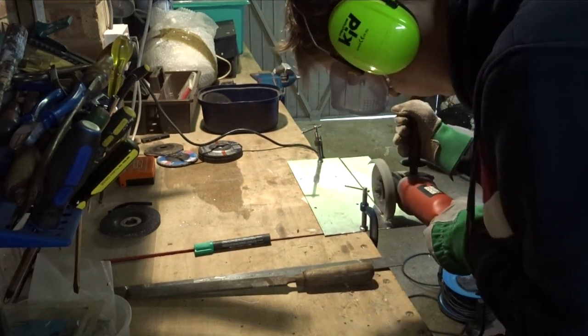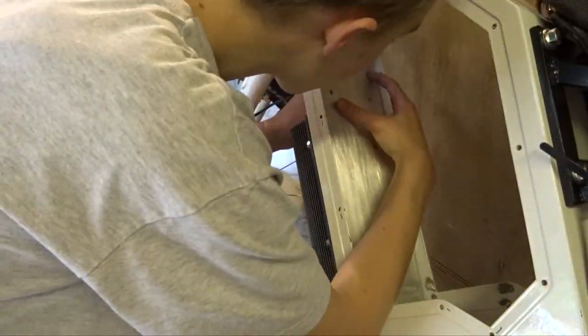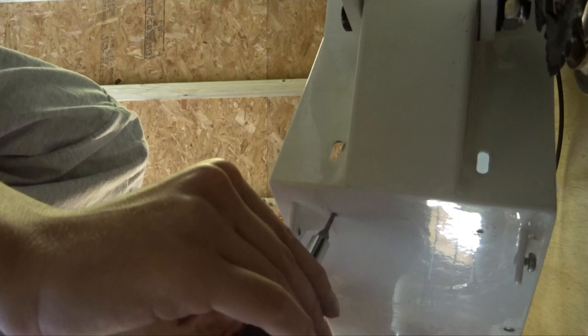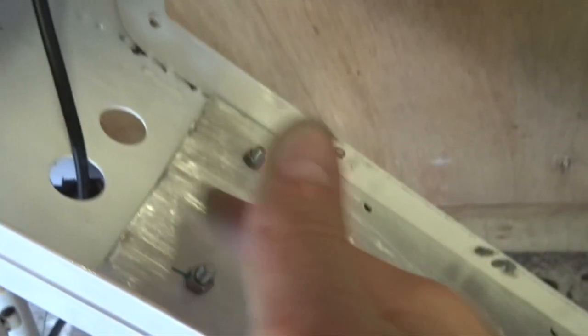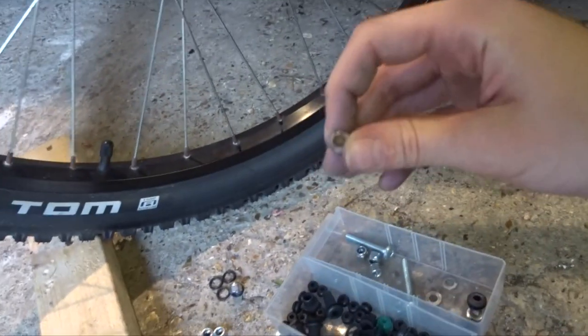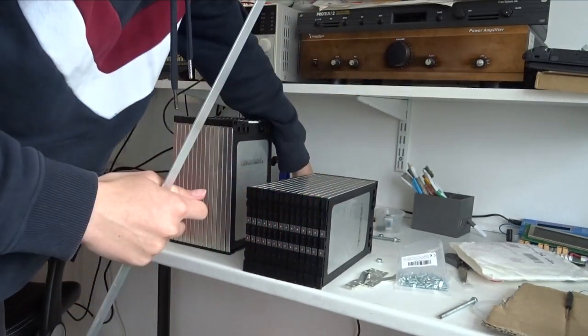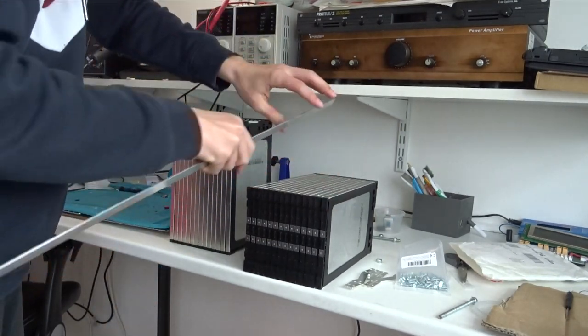After grinding I started making the aluminium plate that goes at the bottom to support the batteries. I cut out the sheet of aluminium, filed down the sharp edges, measured and drilled the existing battery mounting holes, and with some washers and spacers it all fit just fine. The plate is now in with two small screws to stop it bouncing up and two main holes aligning with the intended battery box holes. I also made aluminium flat bar straps — a rod goes across the top and the straps are bent around to pinch the bottom together — two straps, one on each side, held by bolts.